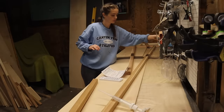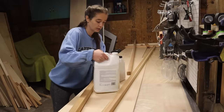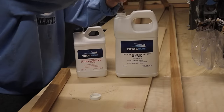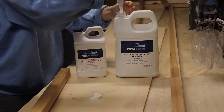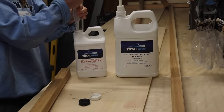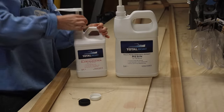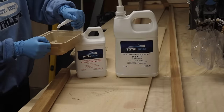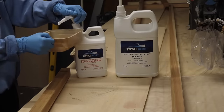Back then, the sub-freezing temperatures didn't get me, but my refusal to follow directions did, and I ended up with an improperly mixed epoxy that left me with a permanently sticky mess of a countertop that had to be completely torn up and redone. I am using a different epoxy this time. This one needs to be mixed in a 2 to 1 ratio and comes with these handy pumps that measure for you.